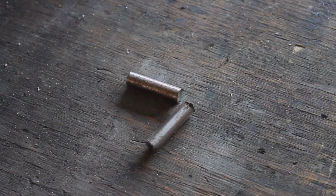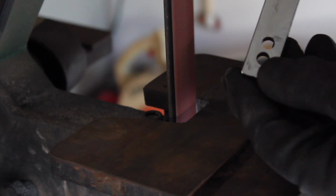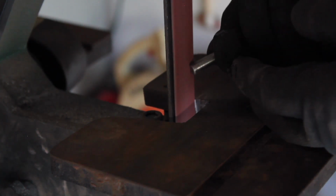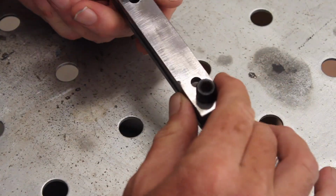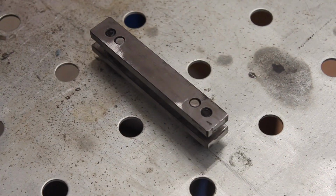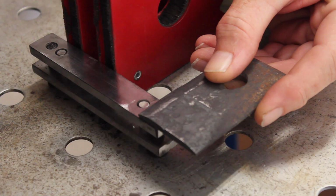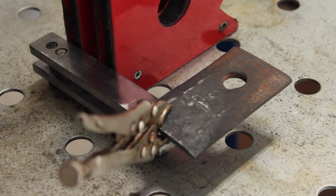And of course, for this application, I don't really need titanium or carbide. When I'm making these plunge lines on the knife blade, the sanding belt shouldn't really be in contact with this guide, just the edge of the belt. So it shouldn't wear that much, and if it does, I can grind it down flat probably multiple times before this tool reaches the end of its life.